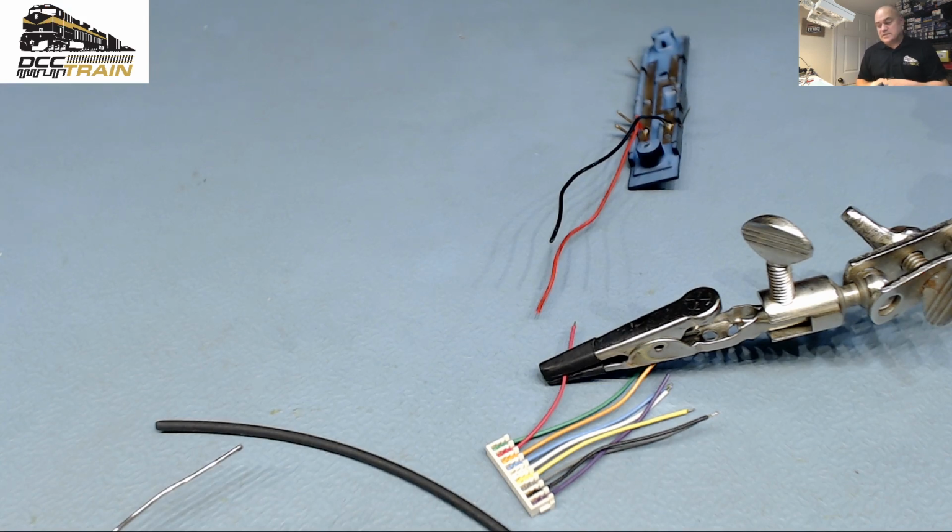Hello, hello, hello, guys. So that's the basics. Without flux, just the solder and two wires, it's completely basic. You just take the soldering gun, put two wires together and put solder. No good. It's called cold soldering. Without the proper structure, the process is just not done properly, because the surface is not clean, it will be an oxidized area, and finally it will lose contact.